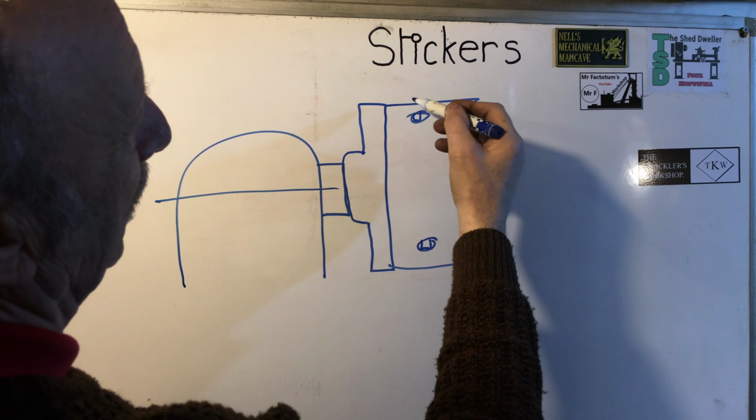That's a lot better. I had a few people ask why my chuck has scallops in the chuck face. The answer is, I don't know. But what I do know is that this chuck has a very clever trick up its sleeve. That is that the workpiece, as it's nipped up, is drawn into the chuck by a very, very small amount. I don't know why, but presumably to prevent the issue that other chucks have when their jaws are tightened, and that is that the workpiece is very, very slightly pushed out.